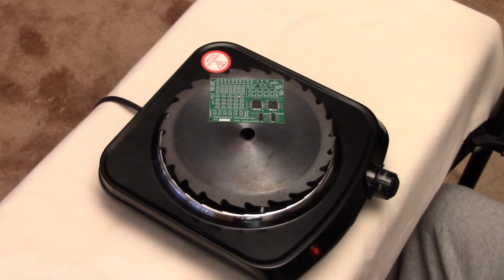Oh, one thing I wanted to mention. Of course, the controller would eliminate the need to watch the stopwatch, because it would just do everything automatically. But a better, simpler solution might be for you to just make a voice recording of one session with 5-second countdowns to each change in the power level. Then for all future sessions, you could just play that back on your phone and listen to it, and you don't have to watch the watch anymore. So I think this could be pretty convenient for a lot of people. So let's go look at that reflow video.